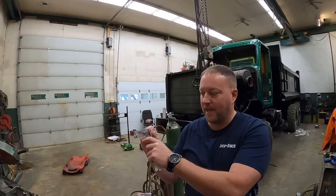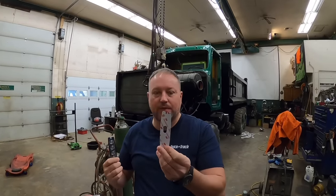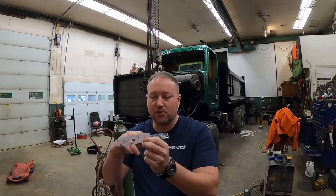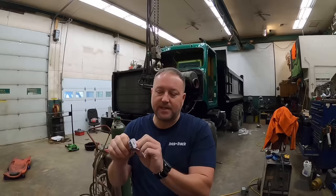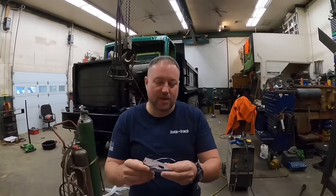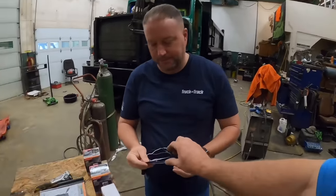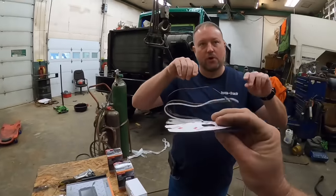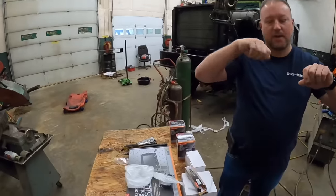It's going to have the white and the yellow. We do two colors. Remember, your human eye doesn't really see white that well. So if somebody's driving down the road, two colors really get their attention. So, dual color light. It does come with this 3M adhesive, and I would use it. Stick that up there and use it as your template for the holes to drill. Then peel the adhesive off, actually glue that up there, and finish with a couple of screws. That seals off the back and really holds it there. So you can peel off one side, stick it up where you want it, drill all your holes, then peel the second layer of tape off and stick the light to it.